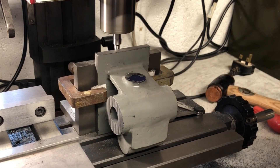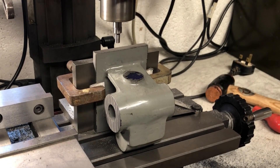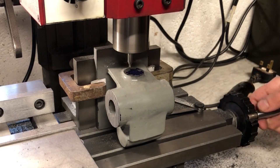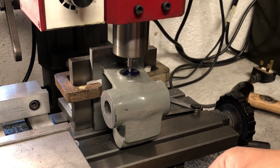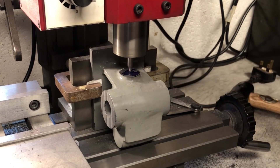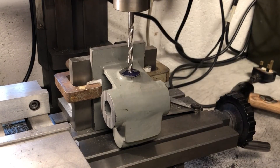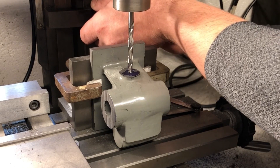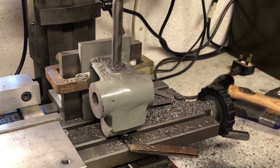Now I'm edge-finding the base, as the position of the hole in the boss is reasonably critical — it has to intersect the spindle bore by a prescribed amount. Too little, and the spindle lock may be ineffective; too much, and there is a risk that the cotter may jam and therefore not release smoothly. While this position is critical, the horizontal is purely cosmetic, and so the centre of the boss has been laid out on the surface plate, and the centre drill is aligned on this axis by eye alone. The bore is to be half an inch in diameter, so after centre drilling, I'm setting the depth by touching off with the pilot drill and adjusting the depth stop on the mill using a caliper. A feeler gauge of the appropriate size is added underneath for support. The pilot hole is quarter inch, that's enlarged to thirty-one sixty-fourths, before finally reaming out to half an inch.